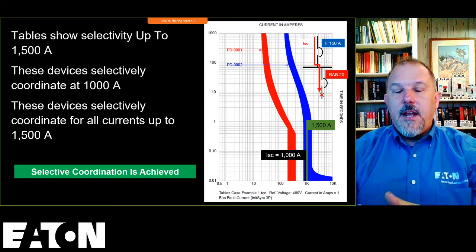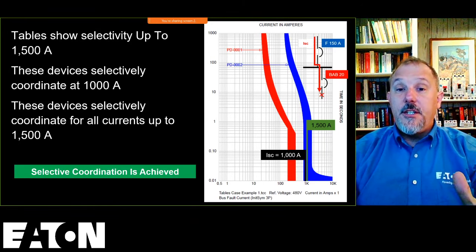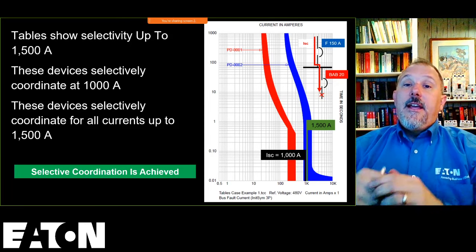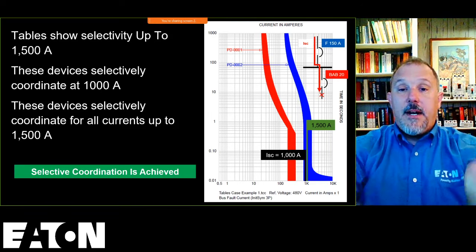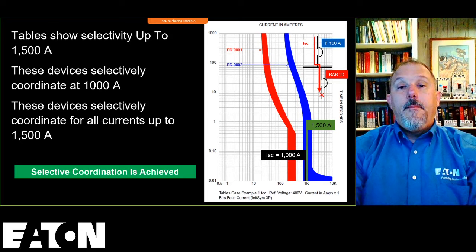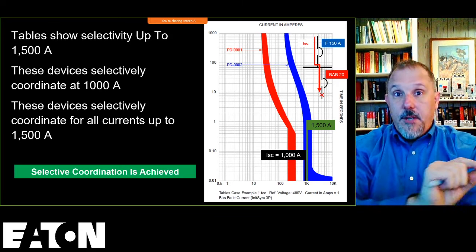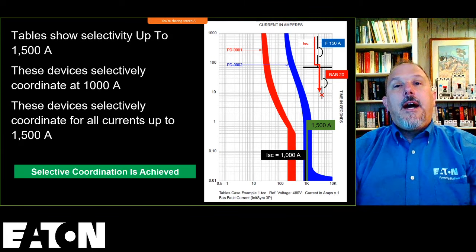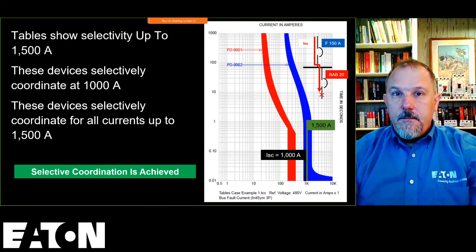Anything 1,500 amps and less, I am going to have selective coordination. So I'm using the tables to say, this is actually okay. If I was doing this for a client, a customer of mine, I would plot this. I would plot my fault current, and I would put a note, and I would say, note that based upon the time current characteristic curve, I do not selectively coordinate, but because I use the tables, and I would put